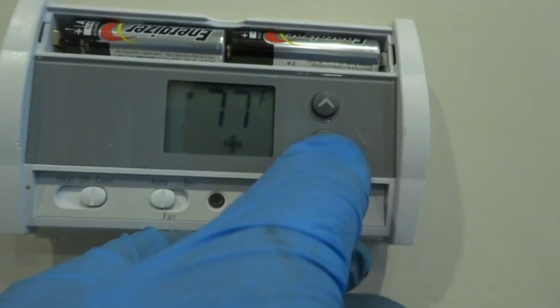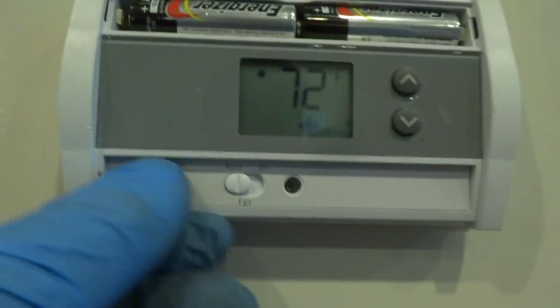It's another Goodman. It looks like another 3-tonner. $36. We'll run it and we'll check the charge. You said this one's been struggling? Yeah. This might be a leaker. Maybe. So cooling. Turn it down so it doesn't shut off and I'll check it.